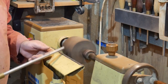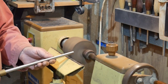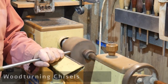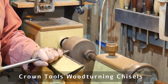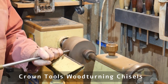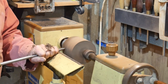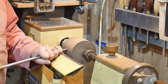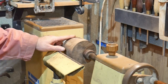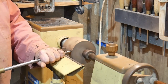First I check whether it engages with the tool rest - thankfully it does not. I turn it on - it's spinning around really fast. I'm using a wood turning chisel made by Crown Tools, high speed steel like what they use to make drill bits - it's a big hunk of steel but it sharpens up very well and lasts much longer than standard chisels. We carefully peel away the wood from the outside of the block to make it really round. I'll leave a link in the description for these Crown chisels - Robert Sorby's are good as well.